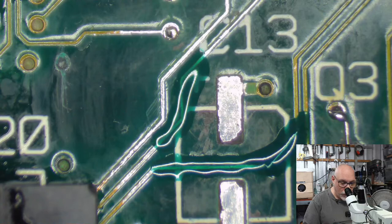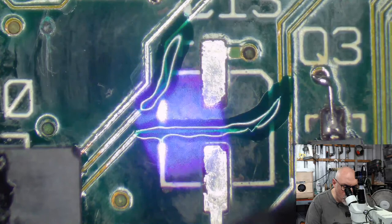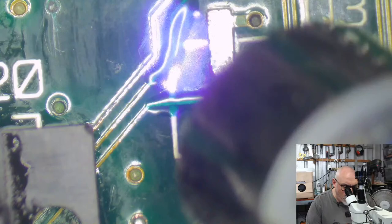One problem with tantalums is that tantalum is quite a rare mineral. So we're not necessarily going to be in a situation where tantalum is always available. You know, we could end up with a situation where there becomes a tantalum shortage. Now there's niobium, that's another one, but there aren't as many capacitor sizes available in niobium. Niobium is a very similar metal to tantalum.